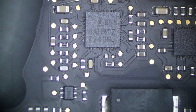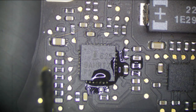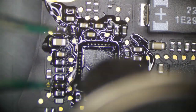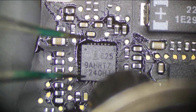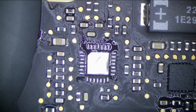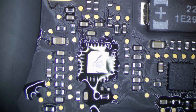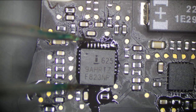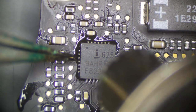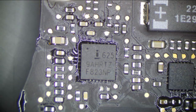The ISL is right down here on this board. You may wonder: should I replace Q7155 and all the other FETs that the ISL controls? The answer is maybe — it's on a case by case basis. Sometimes you'll have to, but the vast majority of times you really don't. I honestly try to avoid wicking the old solder away; there's really no need to. If I can pull it off cleanly and there's enough on the pads, I'll just solder it down. There's that — ISL is on.